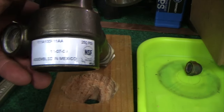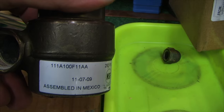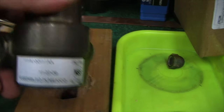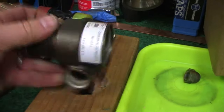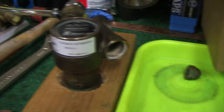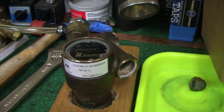The newer pump is better and the sticker has a lot of good information. The part number at the top — the 111-A100F number — is the traditional one you'll see on carbonator pumps. If you have to call up a parts place to get a rebuild kit or other parts, they'll want that number to ensure they give you the right kit.